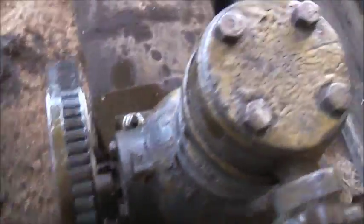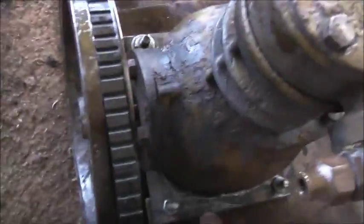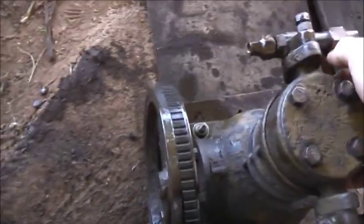The motor's naturally aligned now. I've had it for about half an hour. I pressed it, resealed it, all nice and cleaned up, and refilled it with oil because the old oil leaked out, because the seal at the bottom wasn't very good. It likes to spill a bit of oil out now. Whew, messy. Nice and warm.